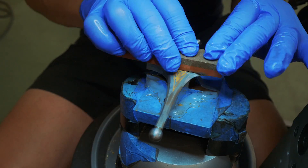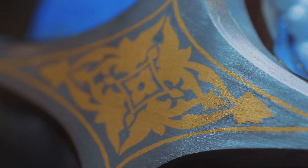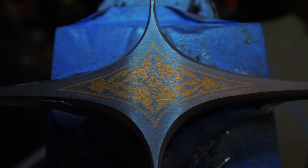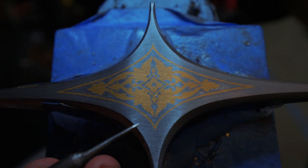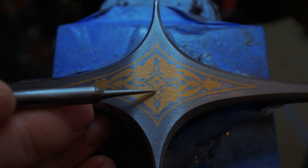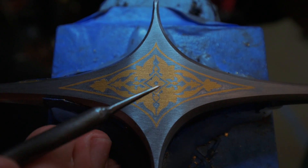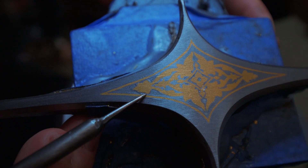Let's get back to the video, and at last our design has come through. By goodness does it look a whole lot better than I thought it would. It is pretty decent — it is not perfect. There are a few little problems: right there is a little bit of a divot from where I chiseled in too deep, and if I grind down all the material to reveal that, there's a potential that our inlay doesn't end up with the depth it needs to stay in securely.